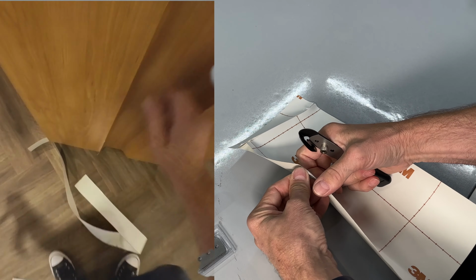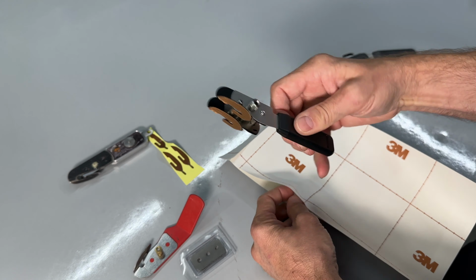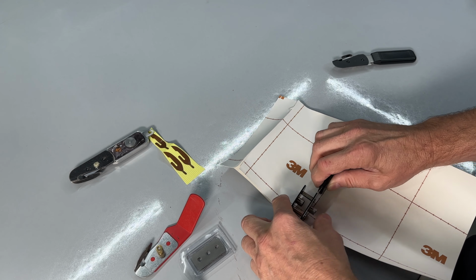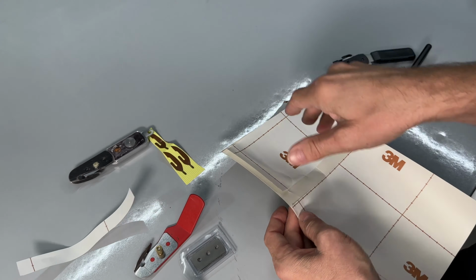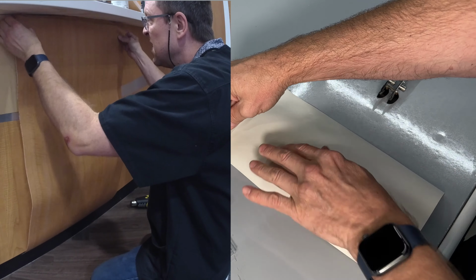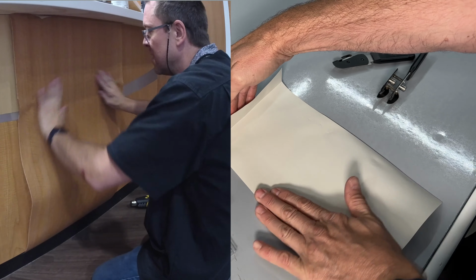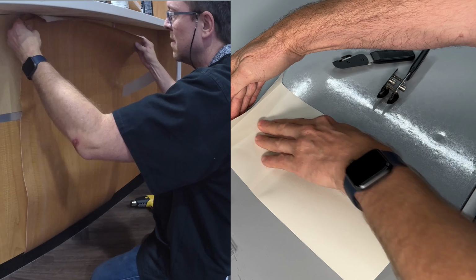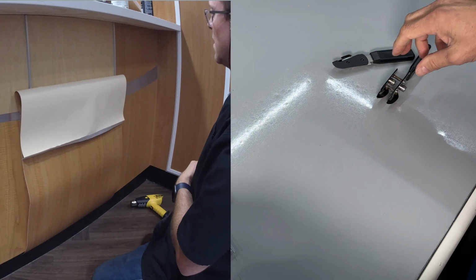And then what I do is I do a double cut. Use your double cutter right here. And you can, what I call tacking on strips. So you tack this on, you take this one little strip, tack it on, so you can put it against the wall right here, and then move it around, and then when you're happy with it, you tack it on, and then it's not going anywhere, and then the vinyl is relaxed, and you go this way. That's one little technique. Okay.